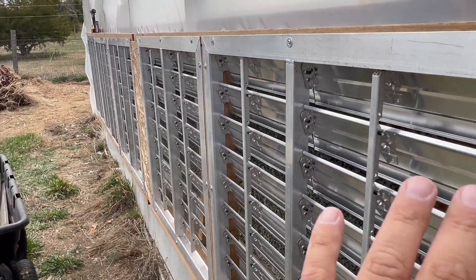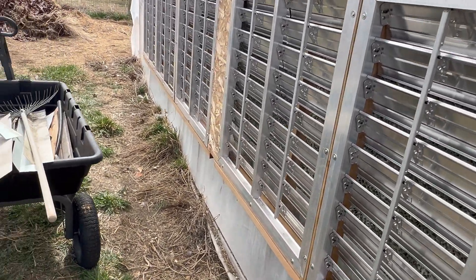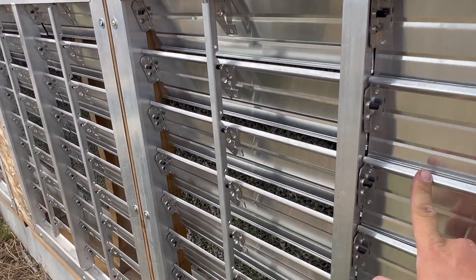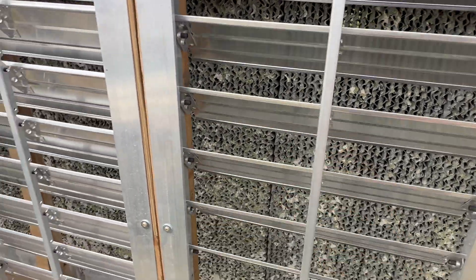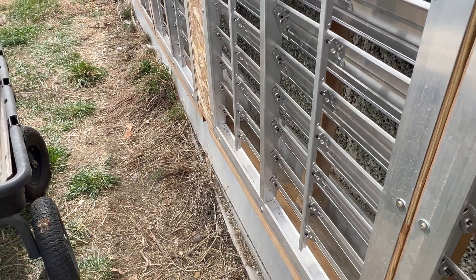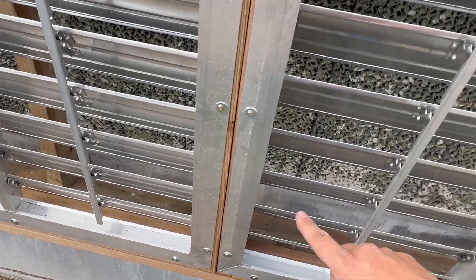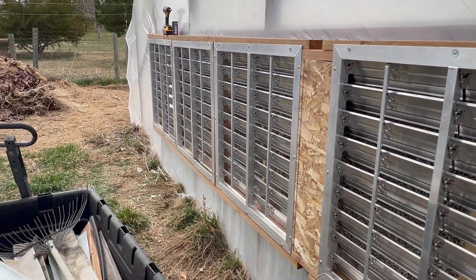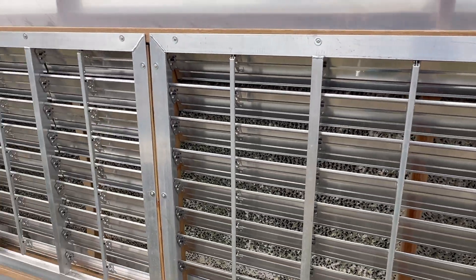So when I was installing these shutters, I had a brain fart and thought I didn't need the flashing anymore. I thought it was just to keep the bugs out, and figured when the shutters are shut they'll do a pretty good job of keeping bugs out. But as soon as I went inside the greenhouse and saw the grass fluttering, I reminded myself — you silly goose — that flashing was also to keep the air going through the pads. So this looks really awesome, but now I have to take it down and replace the flashing.